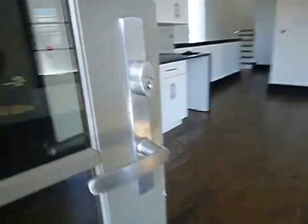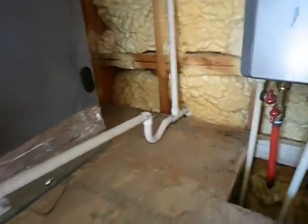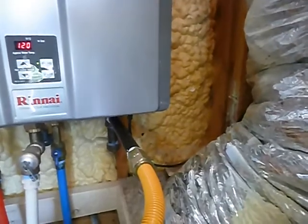There's a thermostat right there. By the way, we're in a closet off of the largest balcony on the fourth floor. We've got a shallow P-trap for the indoor air handler with no insulation, and again the gas wasn't adjusted right, and there's no secondary drain line.